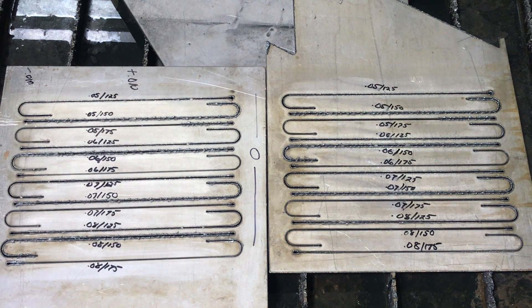I didn't want to finish without doing a direct side-by-side comparison so you can see. The one on the left is without torch height control, the one on the right is with torch height control — and again, they're pretty much identical. So back to my original conclusion: I will use a higher cut speed for this 11 gauge material. Thanks for watching — DNN Custom Creations.